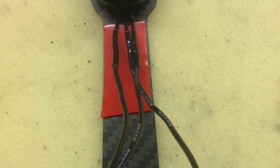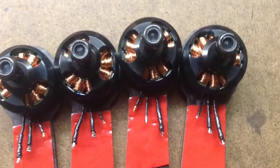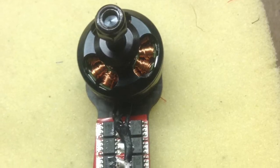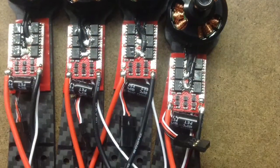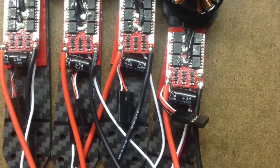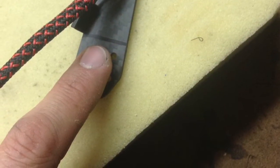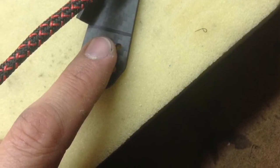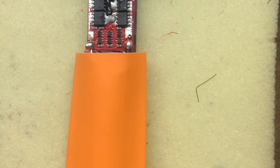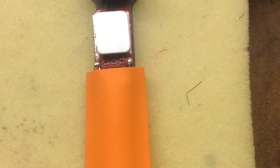The following are several pictures used in the build. They show how I cut the motor wires down to fit the ESCs directly to the arms and how I soldered everything up. You can see I have two left-hand and two right-hand wirings so that everything lines up. I drew a black line where the arm met the plate so I knew where to stop wrapping.